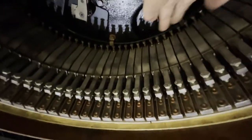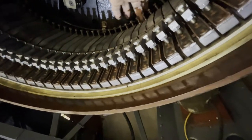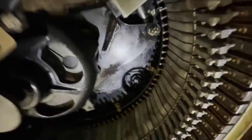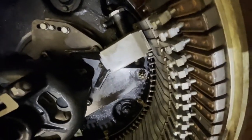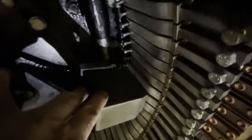The contacts are operated by a kind of piano key mechanism where each of these levers is pulled in to close a contact. And depending how far round the contacts are, that sets the resistance between those taps on the resistor elements and the common outer metal ring. As the magnets move around controlled by the motor in the middle, they pull the contact arms at the top.